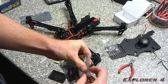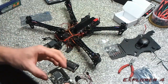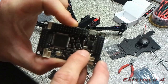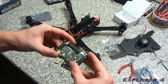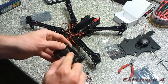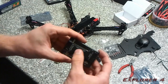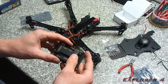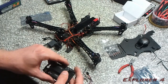but before we do that, on this board there is a pressure sensor, and that is sensitive to light and wind. It's just there. Don't know if you can see that on the video. And when that sits in the case like that, we need to put a bit of foam over it in the center there, in this section here, to reduce the draft and reduce the light effect on the pressure sensor. And basically I'm going to use the same foam that we use for the battery, which is from the gimbal casing.